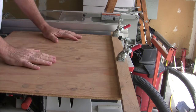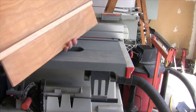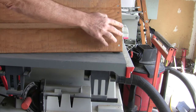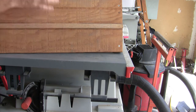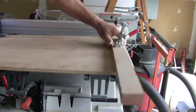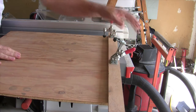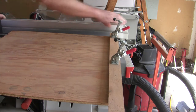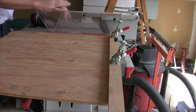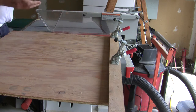To cut the project board we're going to use this panel cutter I built. It's just a piece of half-inch plywood — half and three-eighths. I got this oak wood that I ripped to exactly three-quarters of an inch, which fits into my slot on my table saw as a cross piece. I made sure this was super square. I've got clamps to clamp down the work so it's more secure. We'll remove the fence, put on our safety glasses and hearing protection, then go ahead and cut this panel.